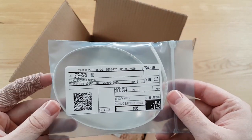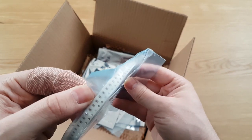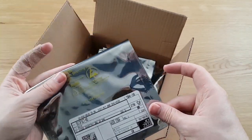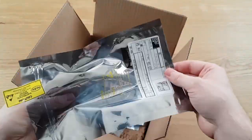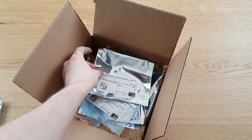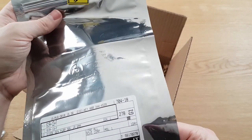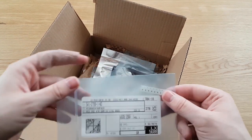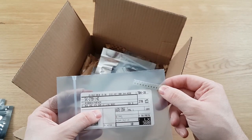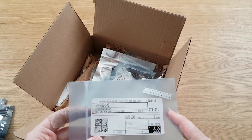So what do we got here? We've got a bunch of 100 picofarad, 100 volt ceramic bypass capacitors — little tiny surface mounts, going to be fun to use. Next we've got some Schottky diodes — fairly beefy diodes, also for my PIR project. More diodes, same size by the looks of it — I don't know why I ordered two different types but I'm sure I had a reason. Then we get to the resistors: little tiny 0603 resistors, these are 47 kilohm. I believe those are for the PIR project.